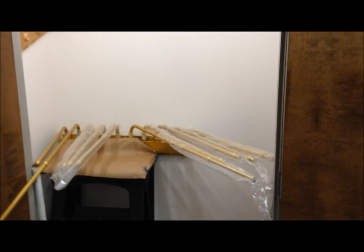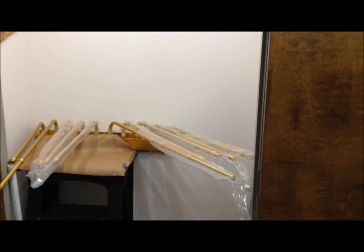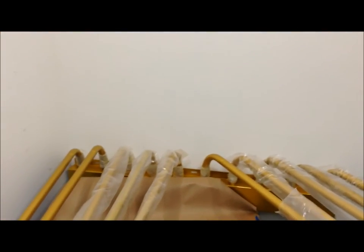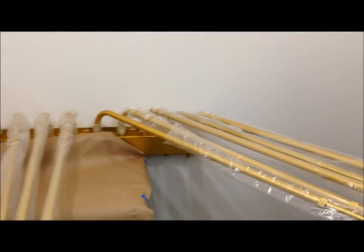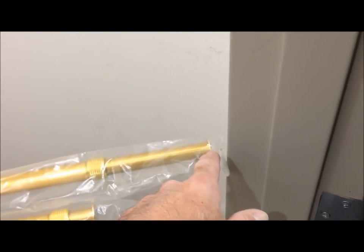Before I bought this I cut some cardboard for sizing up the bracket and brought some pieces of PVC pipe with me, laid this out, and this is what I think is going to work best for us — with that bracket mounted all the way against this far wall. Instead of just having that short distance from the back, now on the longest side, because this is no longer in the center but off to one side, this bar will clear my door frame at 42 inches.